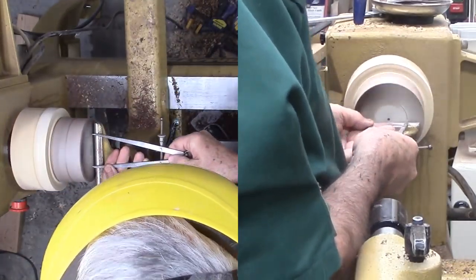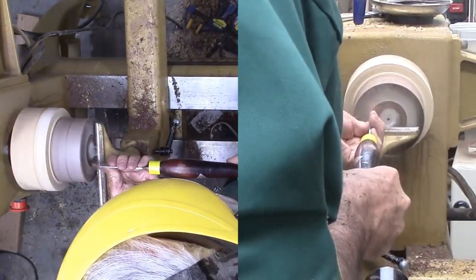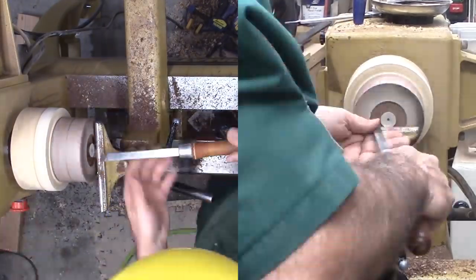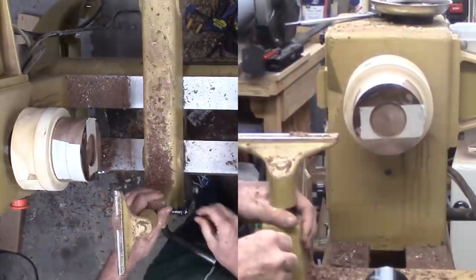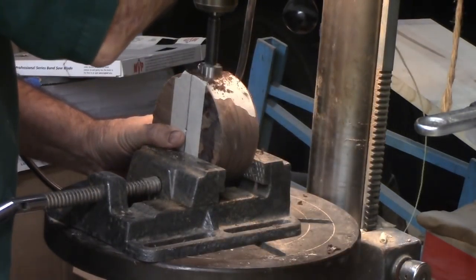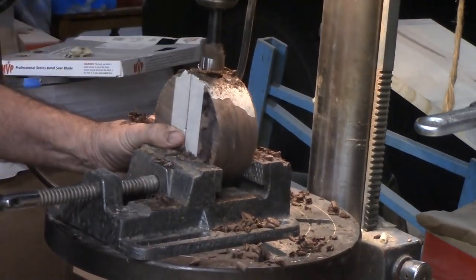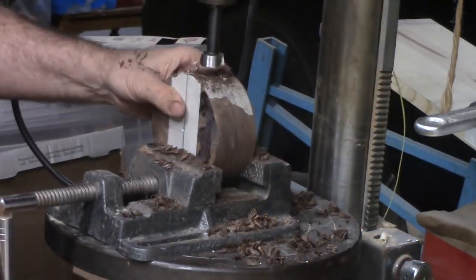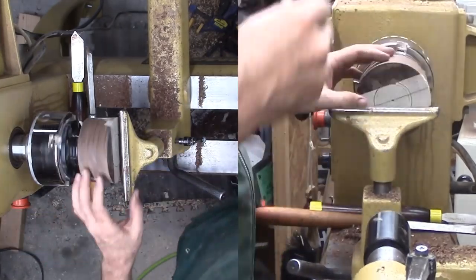This is where I will need to drill a hole for the neck. But before I do anything too rash, I'm marking for an expansion mortise on the face. This will be for my small shark jaws. Then I've applied new tape and marked the exact middle of the wood through the center mark, and continued this mark across the line on the circumference. I've lined up a small drill bit true to the line I drew on the face of the wood. I want my one inch hole to be exactly perpendicular to the tangent at this point. This hole will be for the neck of my vase. Now I've mounted the wood to my small shark jaws using the mortise I drilled earlier.